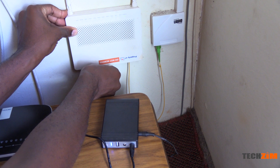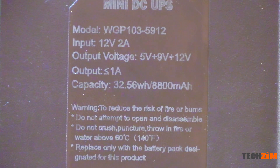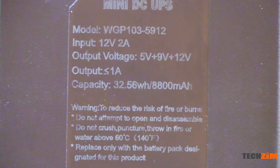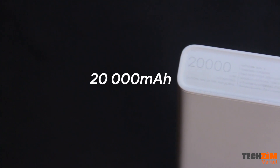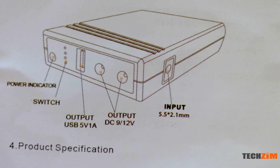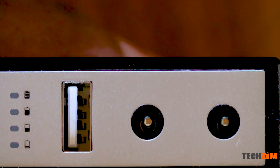But it's not all sunshine and roses though. This model has a few kinks that can throw some spanners in the works. The capacity of 8,800 mAh is far too little for a UPS — it is passable for a regular power bank, but if I had it my way I would prefer one with at least a capacity of 20,000 mAh. The USB port only supports 5W charging, which is the slowest charging you can get — I expected more from a UPS. And it would be really nice if it had a port for charging a laptop.